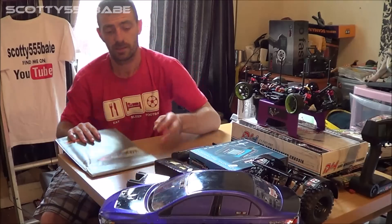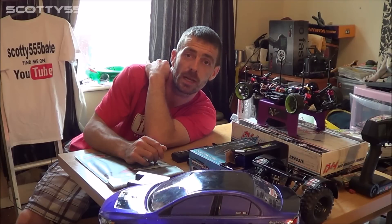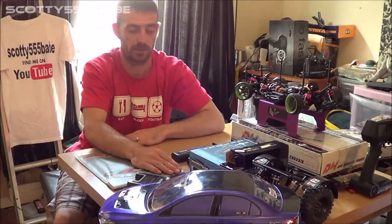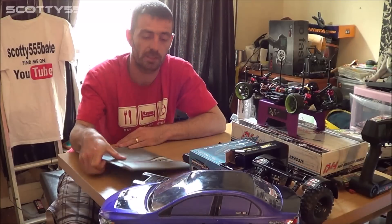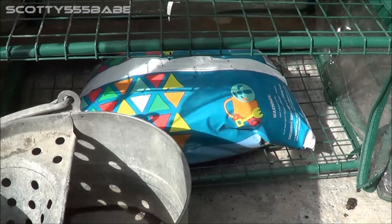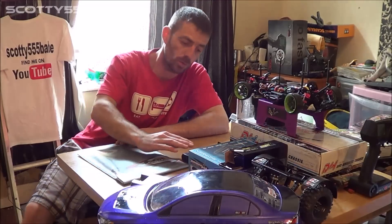I charge my batteries in a bag for safety reasons. There's a video on YouTube on Hemi Storm's channel where he goes to his friend's place who had an accident — he left his LiPo for a few minutes and came back to find his workshop burnt down. It's quite shocking. I've got two precious little ones that sleep in the room upstairs, and god forbid if anything happened — the worst case scenario, all through charging a LiPo pack. Is it really worth it? So I have my LiPo bag, but I run it on an extension lead into the backyard and I have a metal bucket and a bag of sand to put it in while charging, just in case. You might think it's a little over the top, but I've got two precious ones in this house.